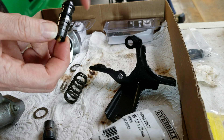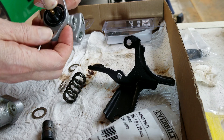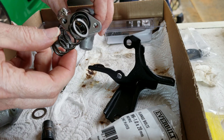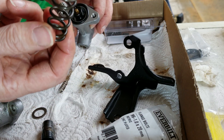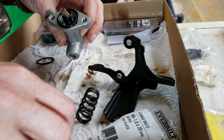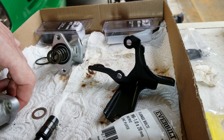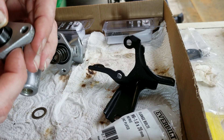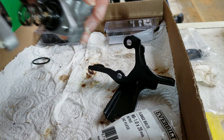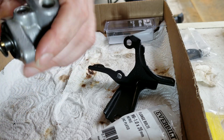So we put this guy back together. Like I said, I took it apart to show y'all again where these O-rings went. This just fits down in here. We have the little silver washer — it fits right up in there. And this spring meets up against that washer. Those washers are in there to keep the seat on the spring from marring the valve body. This little guy goes on the brass on both of these. Put the other side back together, and then these guys fit in here like so.